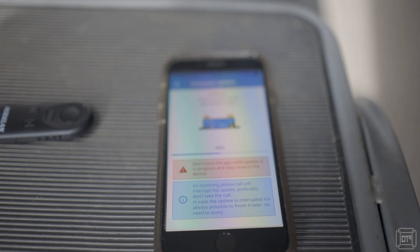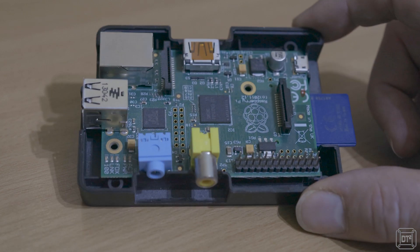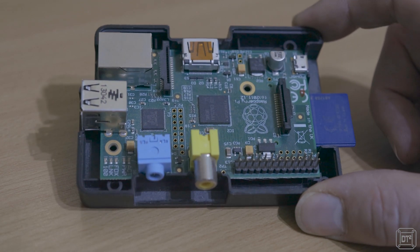As a developer I can understand that the onboard memory of the shunt itself is likely to be limited, so as a standalone unit it makes sense that it can only display current data. But the solar controller evidently has onboard memory to store historical values and the ability to make them available to the app. I'd like to see Victron use this by allowing the solar controller to receive information such as daily battery max and min state of charge, total energy use per day, and perhaps even temperature readings from the optional temperature sensors. All of these should be achievable through a firmware update, which can be performed easily via the app. There are alternative ways to record this data, such as connecting a Raspberry Pi, but the off-the-shelf solutions Victron already offers are so close to doing that job that building this functionality in would, in my opinion, be a great idea.